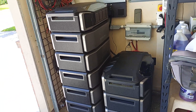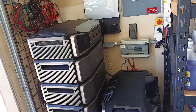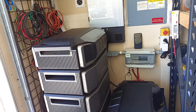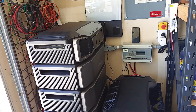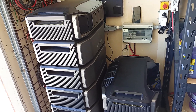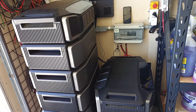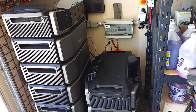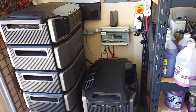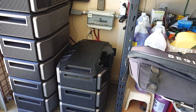I have seven batteries. They generally get me through the night. Here in the summer I use the house fan a lot, so it runs about 300 watts all night long — not that big of a deal. But it doesn't quite make me through the night right now because with the angle of the sun I don't get all the charge I could. So more batteries and another array will help that — particularly a third set with another array will totally help.